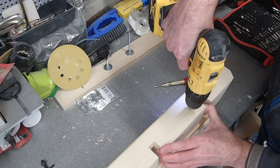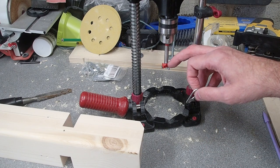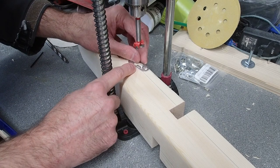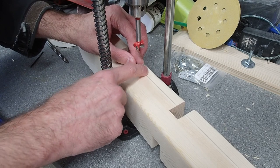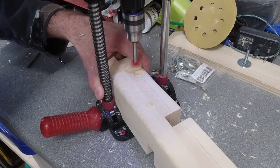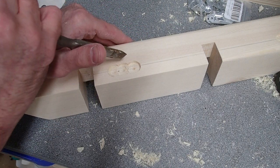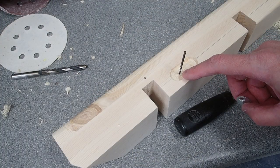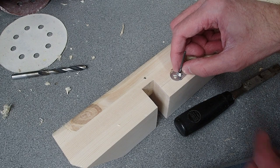Here's a quick explanation of the setup: I have an 18 millimeter Forstner bit and the depth stop is set a little bit deeper than the height of the fastener. The hole is going to be at the top of the keyhole, so I need to drill out to the top and go down. Once everything is drilled out, I take my oldest, rustiest chisel and straighten everything out, do a test fit — the drill bit should rest on top so the fastener fits nice and snug.